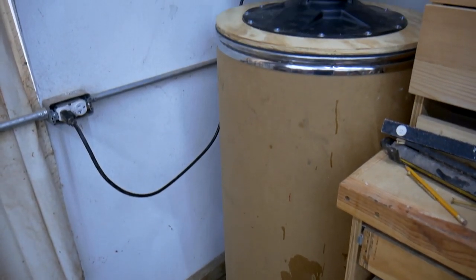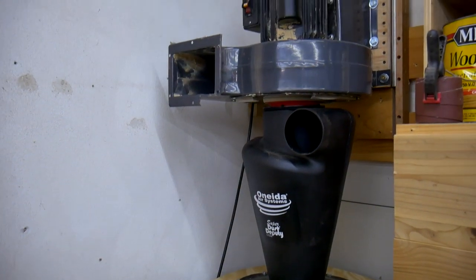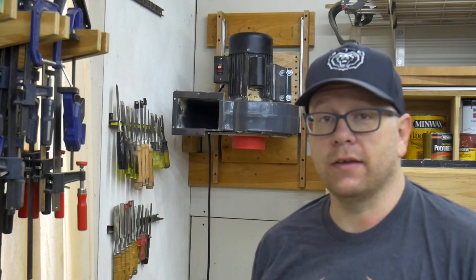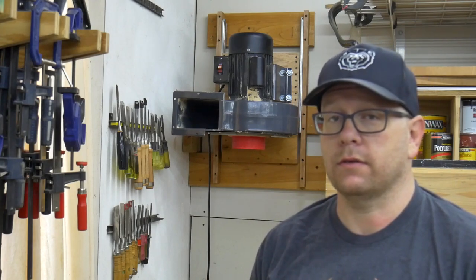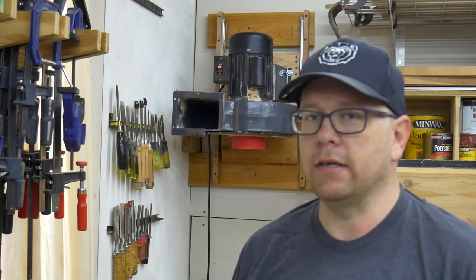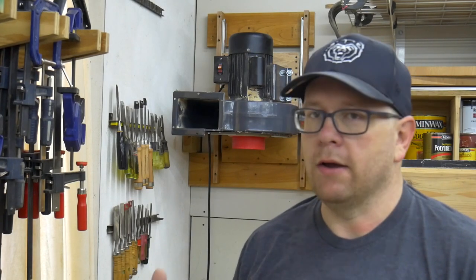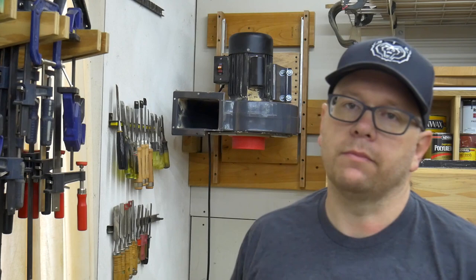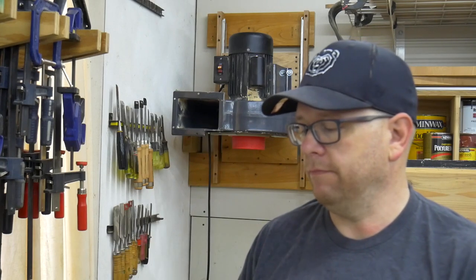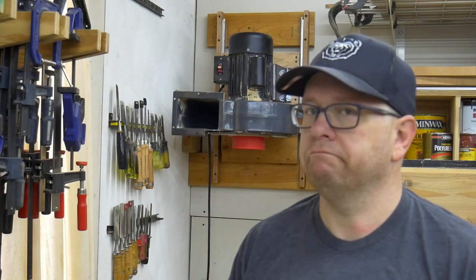Now comes the fun part. Not only is this dust collector extremely heavy, but it is very awkward and cumbersome as well. I attach the drawer slides to the wall and carefully slot the carriage with the dust collector into the drawer slides. Now that the dust collector is on the wall, I did a test fit — but it's the next day now, and as you can see from my struggles, things didn't work out as planned. I had the clever idea of using six-inch drawer slides to give it six inches of travel up and down, so I could disconnect the dust collector from the cyclone or roll the dust bin out. But the one thing I didn't consider was the amount of twisting torque on those little six-inch drawer slides, and basically they just blew apart.